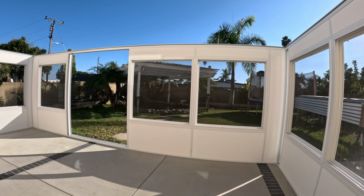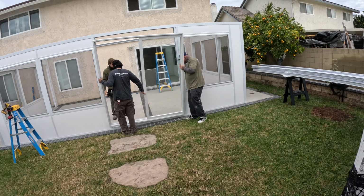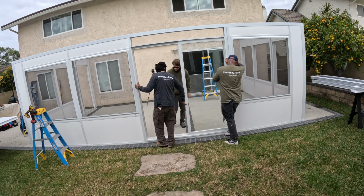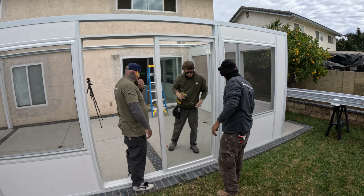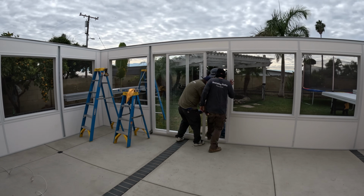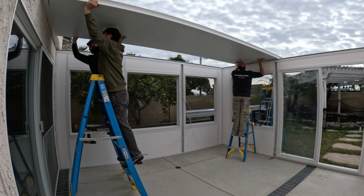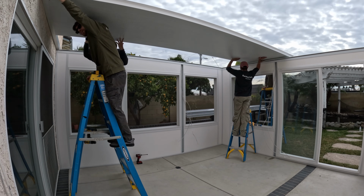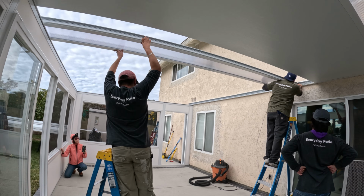And that's most of the walls in. I think all we needed to do the next day was fill in 1 small wall piece, and here's the door going in. So fairly simple on the slider. We normally like to line it up halfway even on the outside and inside, and then put about 2 to 3 screws on each side. There's some screws I've been using from Home Depot. They're black self-tapping screws that work really great for putting them in.